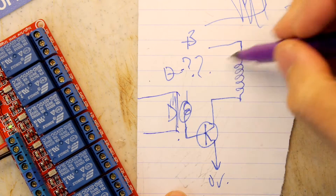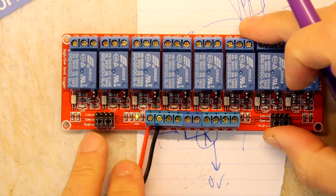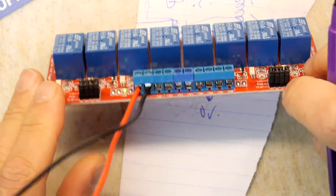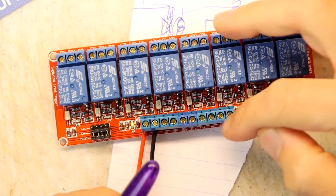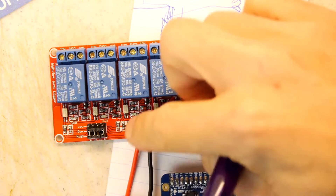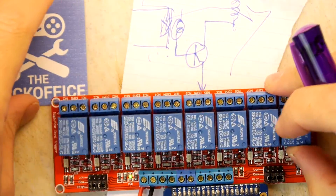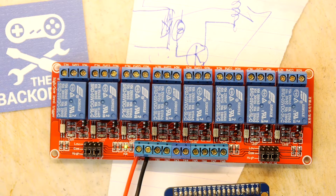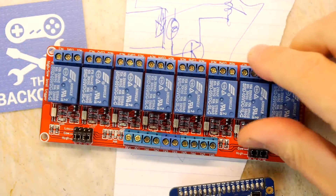The real main idea is to stop anything nasty from the mains end jumping on and destroying your sensitive electronics — how that's accomplished is via these opto-isolators. You can see that these power lines are grounded to this big ground plane. If they're connected to your sensitive electronics then you're all screwed. You're basically just protecting these eight inputs to your controller module, buffered by their own regulated supply. Hopefully you're inspired to make your own project with this — maybe switching on some garden lights, water sprinklers. Please let me know down below if you've used one of these, and as ever, thank you for watching.